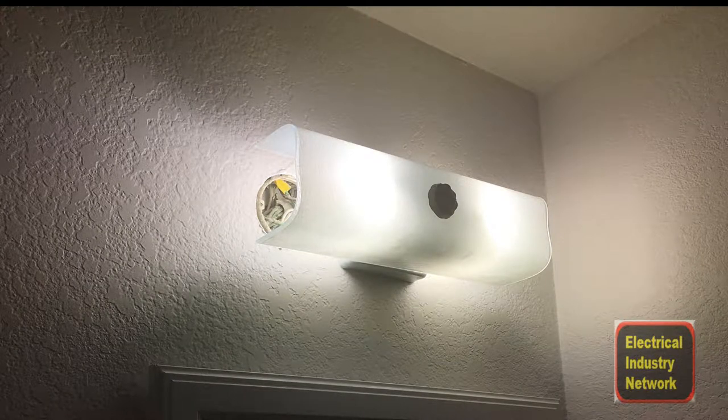Next up is a lack of planning — or a change of mind. I'm not really sure what happened on this one. This is actually at my doctor's office. I think what happened was they had a size mirror in there and changed their mind — they wanted to get the light fixture centered up over the mirror. So they took a little piece of Romex and came out of the existing box and ran it over into the light fixture. Maybe they should have just put a blank plate on there and I wouldn't have noticed it, but regardless, plan ahead and try to get your light fixtures straight and lined up over the mirror.